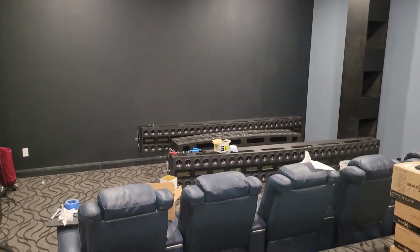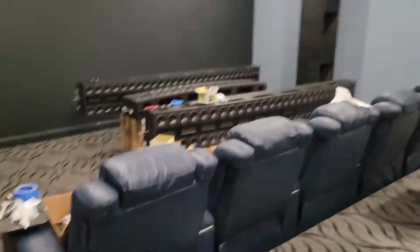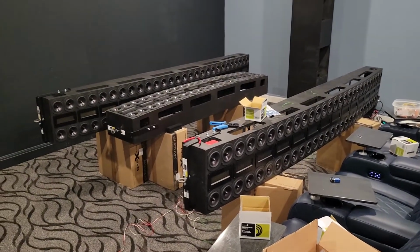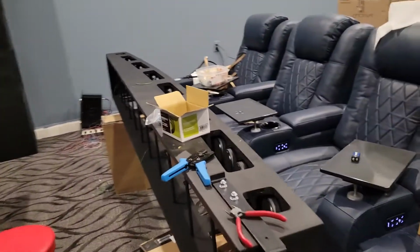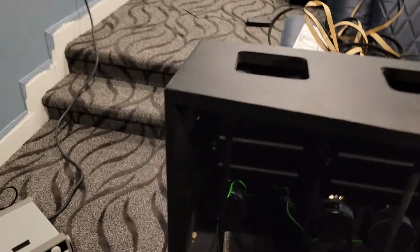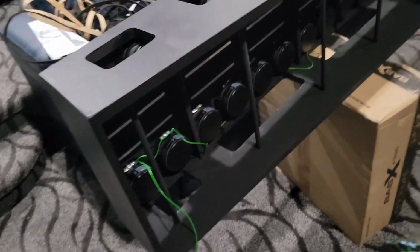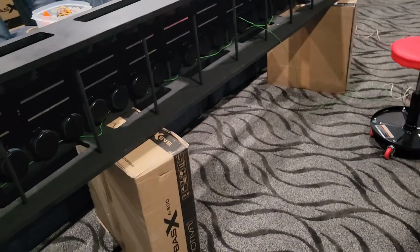It might be a few weeks before I can come back and do any more work, but I'm going to take all the wire and the little spade connectors and crimping tool and all that stuff with me to Portland, so I can sit there in the hotel after work every evening and make wiring harnesses. So when I come home, I can connect all that. And then I've got Speakon connectors that will be mounted down at the bottom of each speaker. It's going to be 2 8-pole Speakons mounted on a strip across the bottom here. 2 for the 5-inch drivers and 2 for the AMTs. And then I'll have 4 Speakon cables that run to the amps.